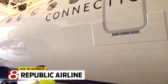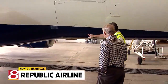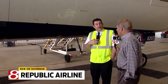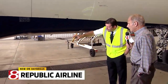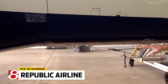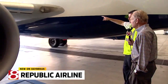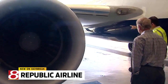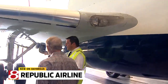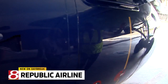You continue walking down the airplane, checking for general conditions. The cargo door here for the forward cargo compartment — we would open that up and make sure what's documented in there is what's actually in there. Inlets down here for the packs, so the air cycle machines — no obstructions again. Continue to walk in: more lights, landing lights, taxi lights, and the leading edge of the airplane. Landing gear again — general condition of it. Just the side of the engine, the pylon — make sure all the panels are in place.